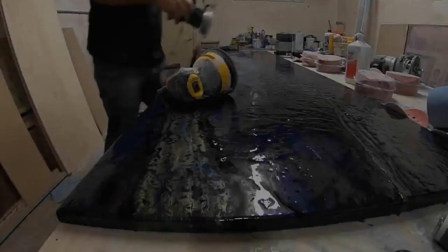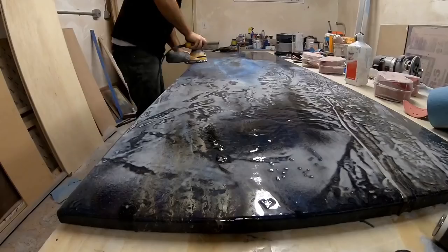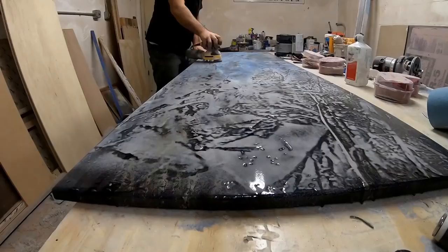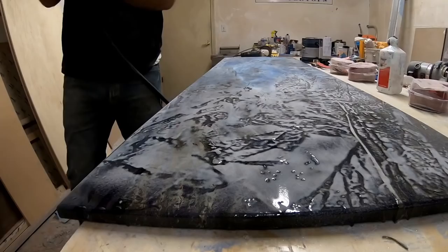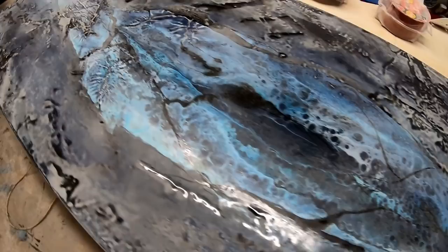We're gonna change this project up a little bit. This is a special color. We're going all out. So we're gonna sand with 220 grit. We're gonna create a mechanical bond by doing this. Then on this next coat, we're gonna apply some color. We're gonna use our Stone Coat Countertops ocean blue metallic mixed with alcohol, and we'll spritz and spray this in the clear coat. This is gonna give us an iridescent effect. We're gonna skip trowel this to make it look very natural, and then we'll do our final clear coat. Let's get started.